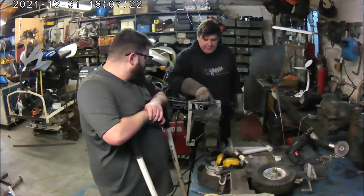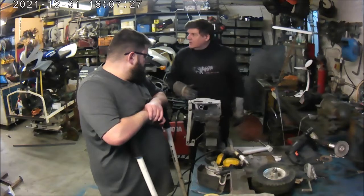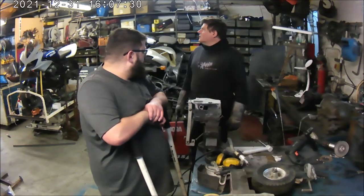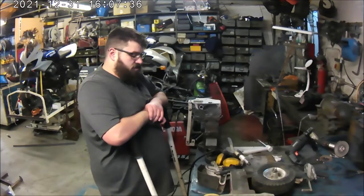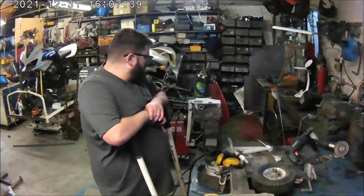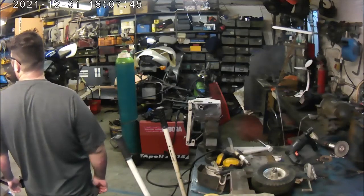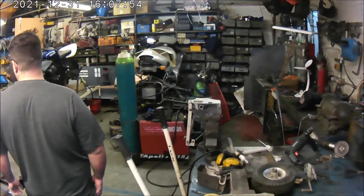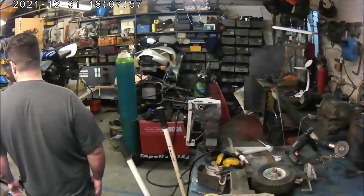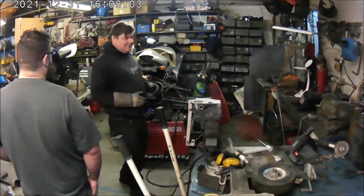So originally the plan was to turn these units upside down, which obviously, because it was designed for a Goldwing, ground clearance wasn't a big issue, whereas for a sports bike, ground clearance is everything. So we were going to turn the units upside down and have the rams at the top, but when we actually tried it, we realised that the locking system was designed to work in the down position, not the up position. So when we reversed them, we had the whole thing the wrong way around. So what I'm doing at the moment with cutting the slots, I actually had to backtrack and go over it again, and I've changed it all around again, and this time I've put the rams at an angle which keeps them up off the road.